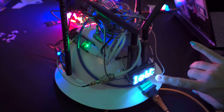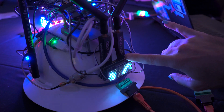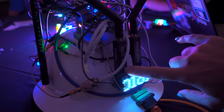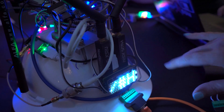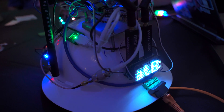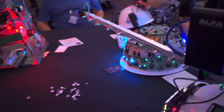Down here we've got a Raspberry Pi Zero W with a scroll hat mini just to do some signage. Then this NooElec Smart RTL-SDR is capturing ADS-B — not so well since we're indoors, but outside it works great. This one is running a program called RTL_433, which is analyzing protocols on all the ISM bands — so anything from garage door openers, fan controllers, wireless tire pressure monitoring systems. Essentially anything using no cryptography in those bands, I'm live decoding.